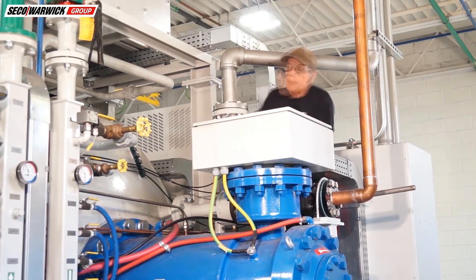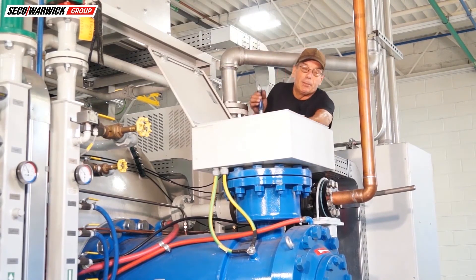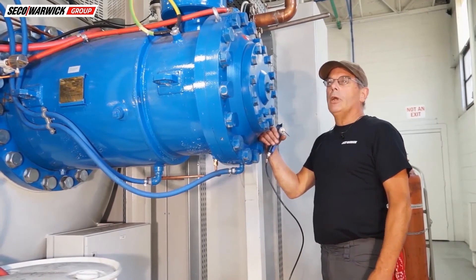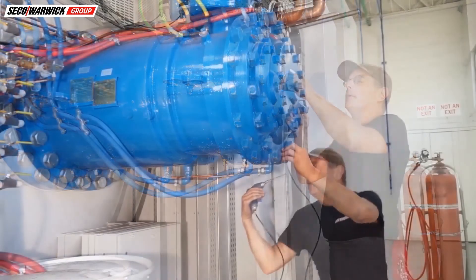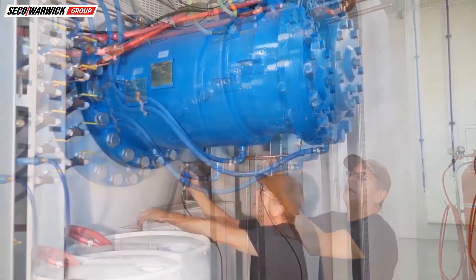We'll give it a few minutes. The blower motor is at identical vacuum as the furnace because they're tied together, so we have to check the copper feed-throughs around it — it's a simple PTFE seal with a flange nut holding it, and there are six of them for the high and low speed. I'll hit each one with helium and give that a few minutes. They did the full lubrication — a lot of times when they grease them they get a little dirt on the O-ring, and if you find a leak and just tighten it, it crushes the dirt right into the O-ring. I'll hit the threads and the actual compression fitting, then check the other grease fitting.